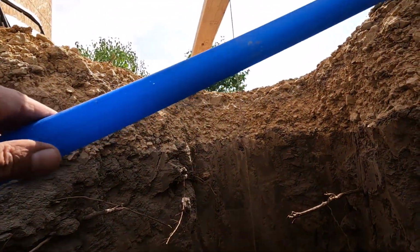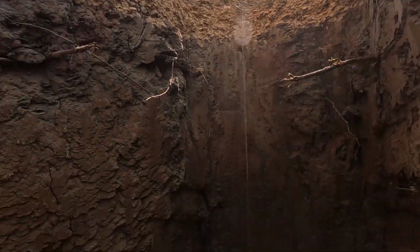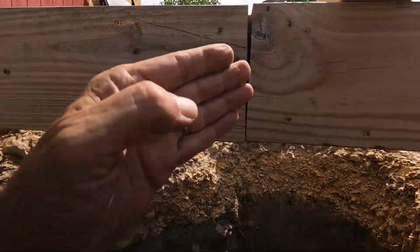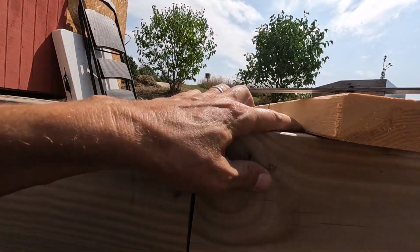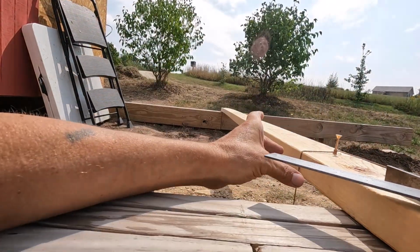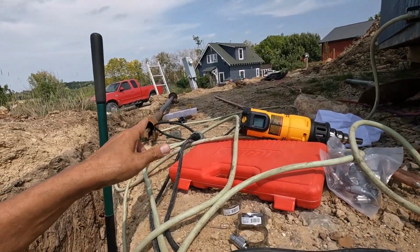Then I'll straighten out some of this pipe a bit, bend it the opposite way, heat it up or whatever. It's got to go straight up, and then I'll attach that, move this half of the diameter of the pipe, because this is set right on the center, move it half of the diameter of the pipe that way, and then attach the pipe to it with a clamp. And then I have the parts.